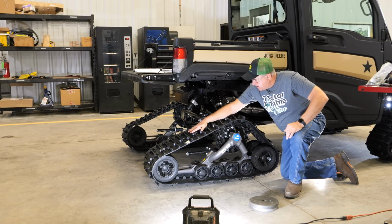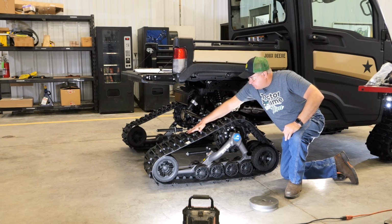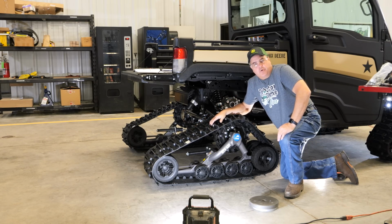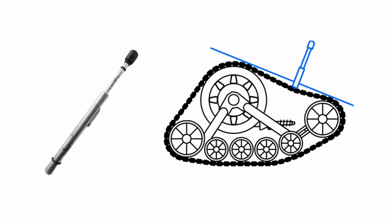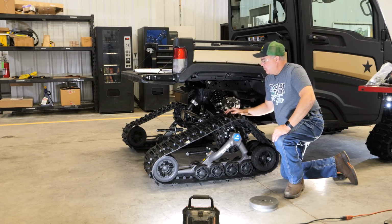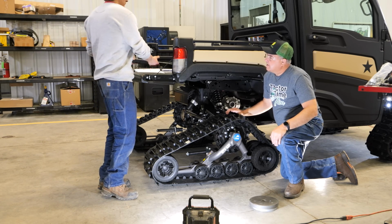And what it says is that if you push down with 24 or 25 pounds of force here, there's supposed to be 3/4 inch of deflection. And there's a tool that you can order. So if your dealer does a lot of these, they should get this track tensioner tool. And we just realized we don't have one. So the guys here have come up with a couple of ideas. Bring your approach over here. Oh, yeah, so we should have a straight edge.